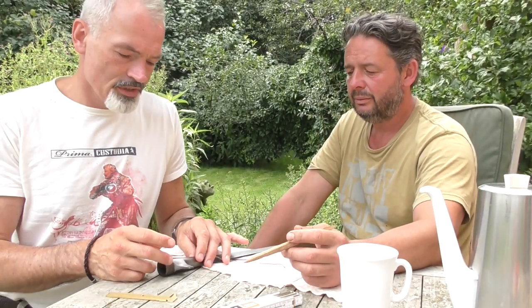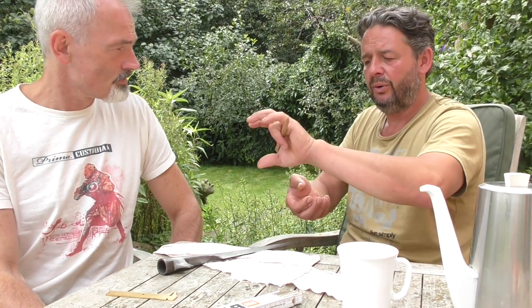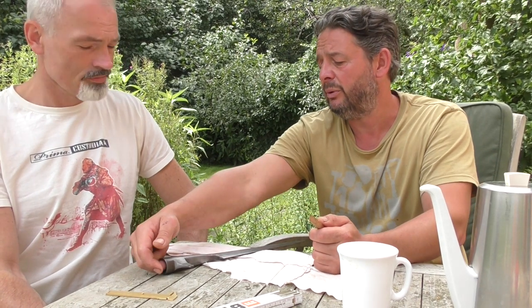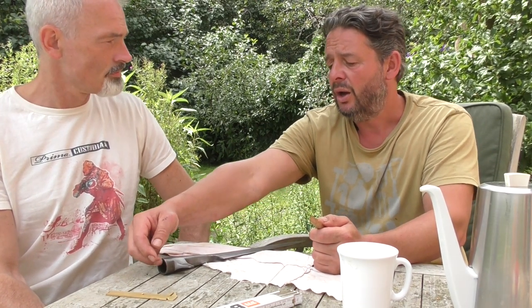Okay, so you have the T-shaped things being welded on. Yes. And in order to achieve that, you need to heat both again to the same 1200 degrees. Same temperature? Yep. Then you need an anvil, like this kind of horn thing where this tube fits on. I actually use the same core that I used earlier to weld it. It has the advantage that you can heat it a bit, and it's good to have it warmed up to 600 degrees, because this thing also cools down, so it's not so critical anymore.